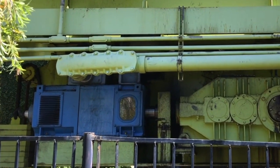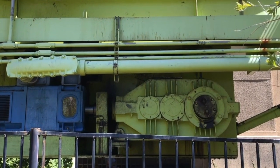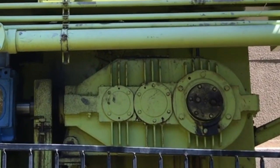Most manufacturers still go with DC simply because they're small. When you compare it to an AC motor, DC motors are pretty small, and you could fit them in a lot of places. AC motors are really big when you talk about a motor that can create 200 horsepower necessary to turn the lift hill. So that motor latches onto a gearbox. That gearbox is a very big reduction gearbox. It turns at 1700 RPM into about 60 RPM, 70 RPM, somewhere right around there on the other side. And that guy is attached to the bull wheel.